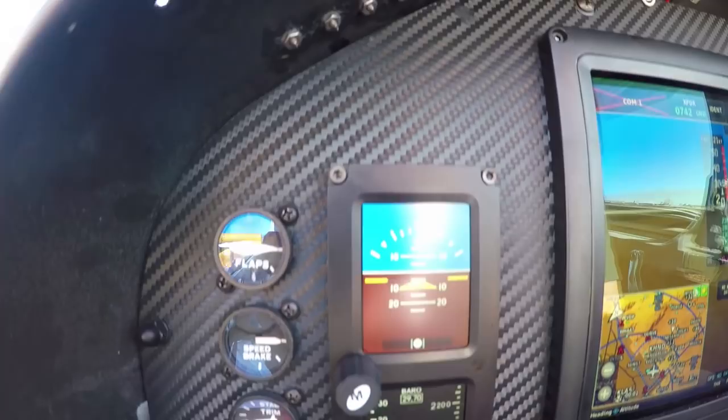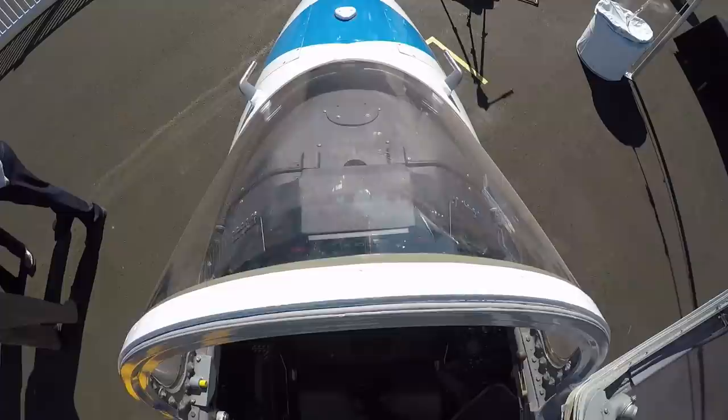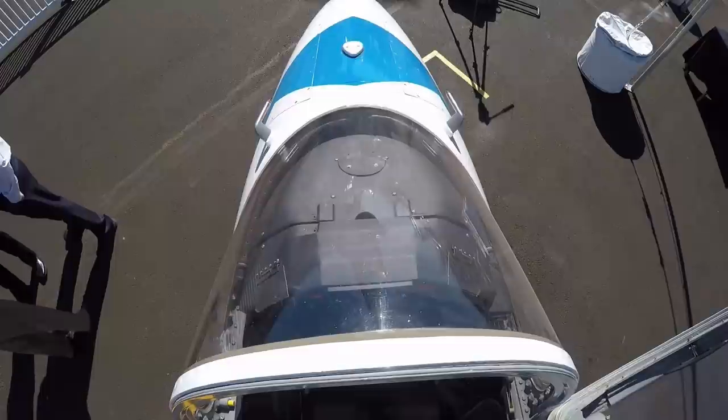The airplane has hydraulically boosted ailerons, which are selectable. We can turn the aileron boost off, which allows pilots to see what a heavier control feel and lower performance roll rate would be like in their aircraft, showing them what the contrast would be in the aircraft they fly.